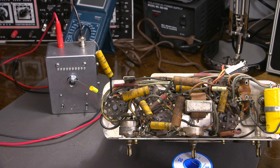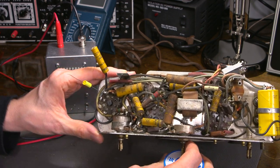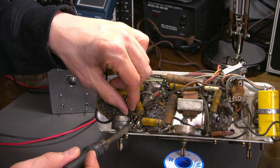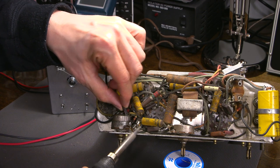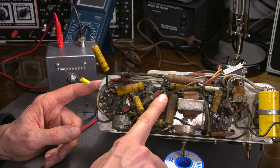Let's test this capacitor right here. It looks to be a mica capacitor. I've clipped the ear off this one - it comes out just that easy. I'll show you what I mean by these ears here in just a moment. There's a really pronounced one right over here. This capacitor is rated at 220 picofarad - the color dots tell us that. I talk about how to read these domino-style capacitors in some of my other videos.